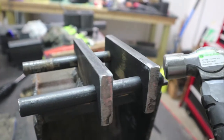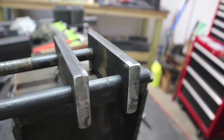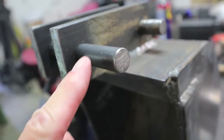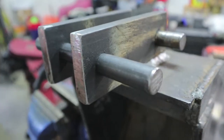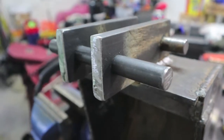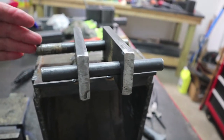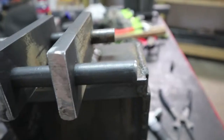It takes a lot of care in laying out the brackets — the five-eighths-inch holes have to be lined up just about perfect. It might have to fit a little bit tight. I went with a five-eighths-inch drill bit on the holes and this is five-eighths-inch hot roll, but I want it as tight as I can get it to start, because these are going to be non-greasable bushings so there's going to be some wear. When laying out parallel brackets like this, you always want to put your pins in and get them lined up as close as you can even before any tack welding.